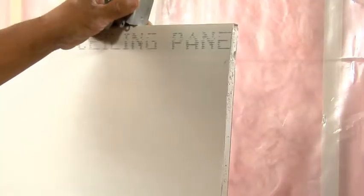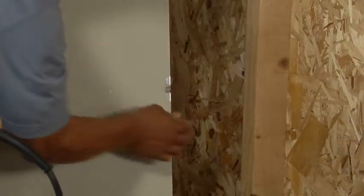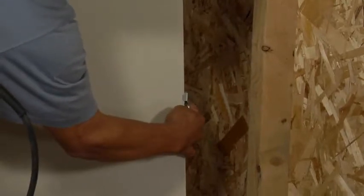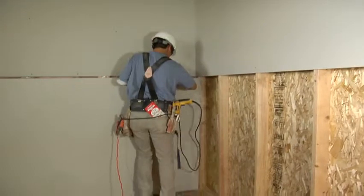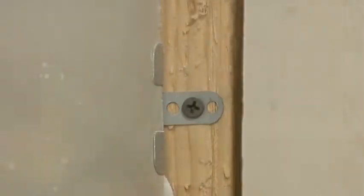Let's start with the Cornerback. First, press the Cornerback clips into place on the end of the drywall. On a typical piece of 4-foot drywall, you'll use three clips — start an inch from the taper and space the clips about 16 inches apart. Then slide the drywall into place with the tab against the stud and place one screw or nail in each tab. The abutting drywall sheet conceals the clips and is screwed into the stud every 8 inches.